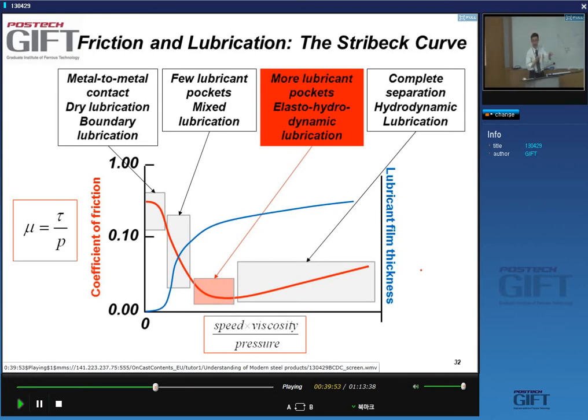And you probably did this experiment yourself once. You have a surface and another surface, and you apply pressure. If you move them very slowly with respect to each other, you can barely move them. However, if you have enough velocity, you'll feel that the two surfaces seem to be separated by a liquid layer. And if you move very fast, you can keep the top surface, the top material, as it were, floating on a lubricant layer, even if this is only water. Have you ever done this experience?